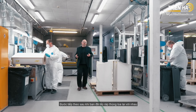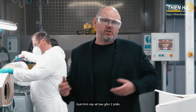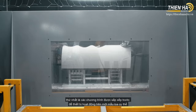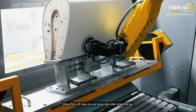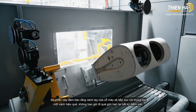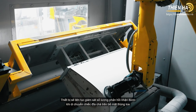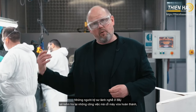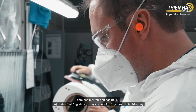The next step is the sanding area, where we work to achieve a perfect finish. There are two parts: first, a sophisticated robot sander using pre-programmed coordinates for each specific model — for example, an 804 versus an 802D4, which have different shapes. It also uses a force feedback sensor to touch the cabinet surface and never over-press at any point, constantly monitoring feedback as it runs its sanding disc over the surface. After the robot sander, operators — very skilled guys — check all the work and finish any final areas by hand.